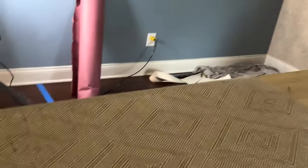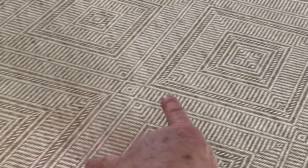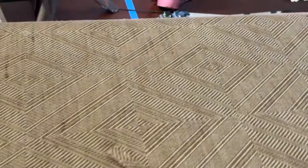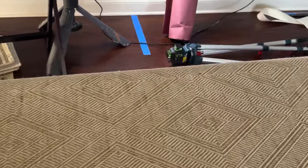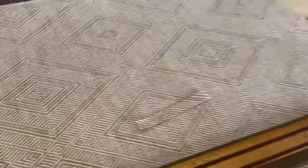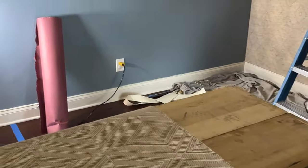Ideally I'd love to cut at this manufactured line right here — you see this kind of light line? That's where I'd like to cut it. But I don't have the money to tell the customer to waste a foot of wallpaper on every sheet — it's just not practical. What I would like to do is slice right down here and join the next piece right here. This is of paramount importance what I'm talking about.